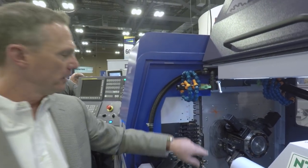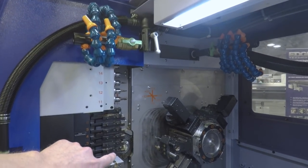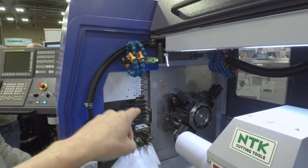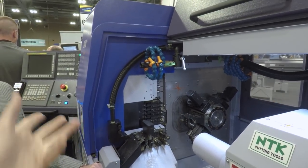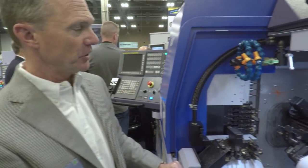Why are we moving in X? Almost limitless possibilities — because I have back working here. So you can do a transfer to the sub, move over, and work off of that guy. So this sub picks off from the main — I can be turning my next part and doing back working simultaneously. That's the beauty of this: a lot of overlapping opportunities, so you're getting free time and your cycle time's going down. And the really cool thing, folks — a lot of the mojo comes from the fact that your workpiece has a very special guide bushing that supports it along the circumference, so you can turn — think about a baseball bat — and you're always going to be cutting near the headstock. The downside is you can't move that part back in, but it's a part you can make on these that would be very difficult to make elsewhere.